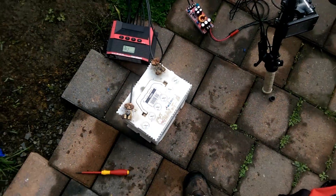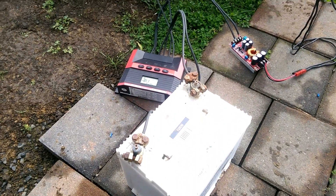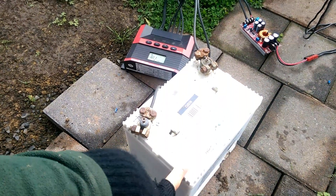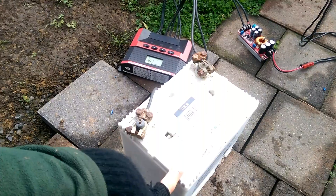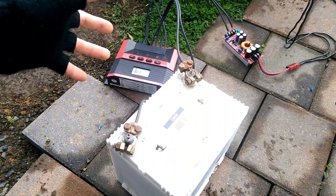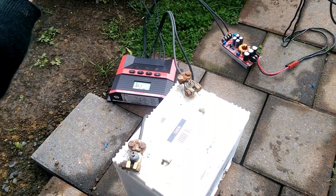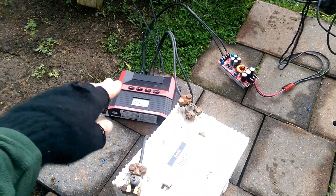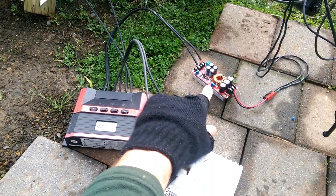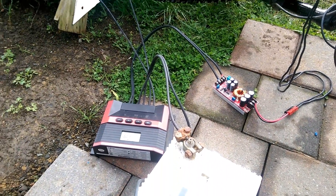However, this is all steps down the line to getting something good made. I don't know if we could use a really small bunch of cells — like three 18650s, which would make roughly 12 volts — or if we could just literally throw a capacitor in somewhere so that it's got some little buffer but virtually no weight. And then of course the ultimate goal would be to combine a tracker, charge controller, and a boost converter into one little dongle box so that you could just carry it around easily.